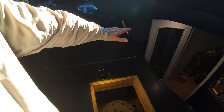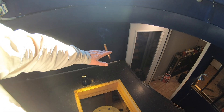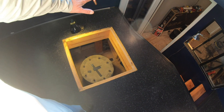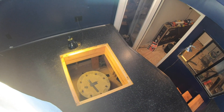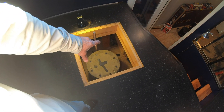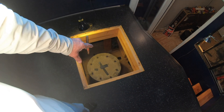That's going to come up probably somewhere in here — probably two feet below the shutter opening. So that pier is going to be about five feet — that's a 12-inch pipe with two half-inch plates. The top one would be 16 or 14 inch and the bottom one's a 24-inch plate with a 12-inch pylon welded to the plate, with supports all the way around.